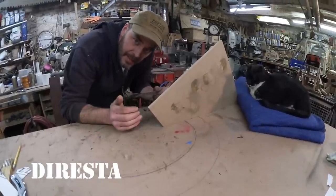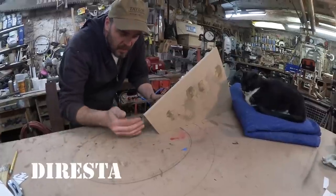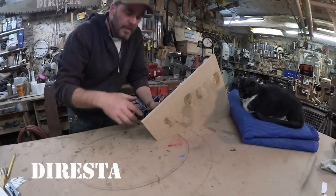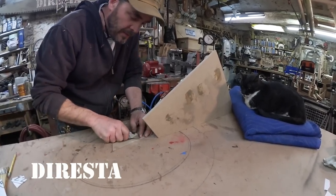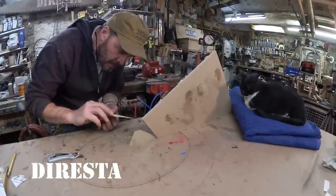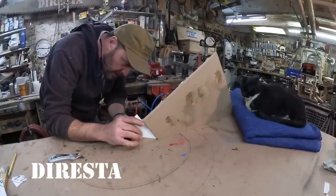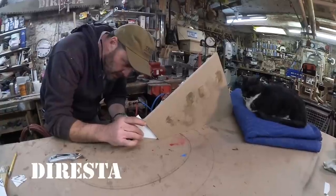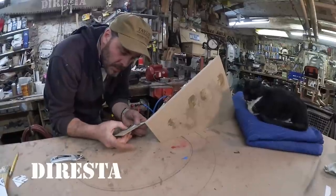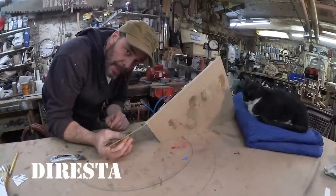This little space represents an inside angle — maybe a cross section of a long length — where you need to know exactly what that angle is going in and coming out. Just like the previous technique: cut two pieces, one for the bottom and one for the other side, get them together, make sure they're snug, and now I can pull it out. That's my angle right there. Glue or tape them together, but just make sure they fit snugly in there, and that's your angle.